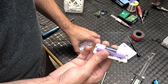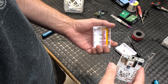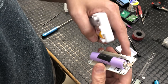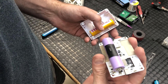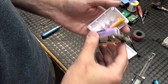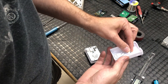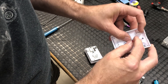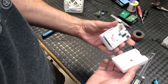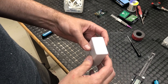I just wanted to show and learn what was inside. The coolest thing I found is that I can add a second battery - it's pretty much a direct drop-in. I'll connect it to the existing holes in the PCB, probably using solder braid, and hold it with double-sided tape. I'm going to charge it up and see if I get 24 hours of runtime. After testing for a bit, I'll report back and let you know what I found.